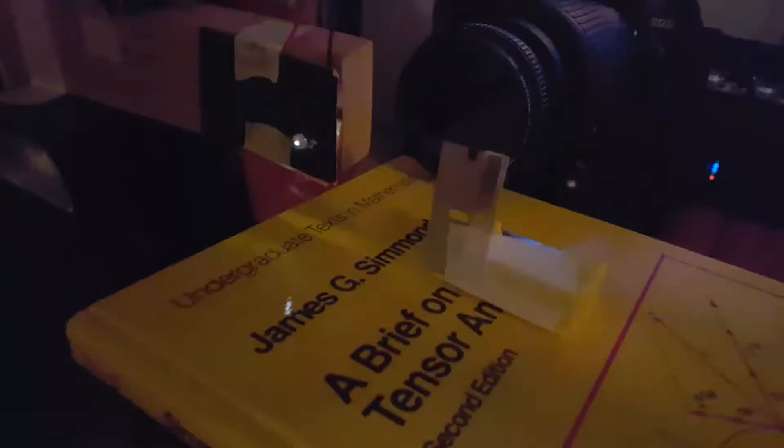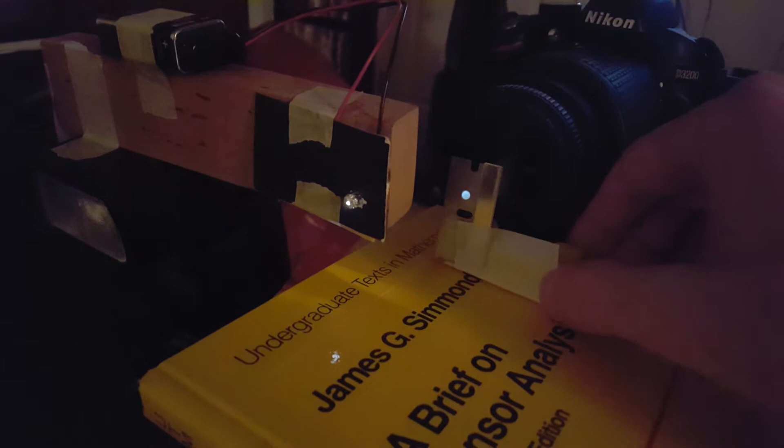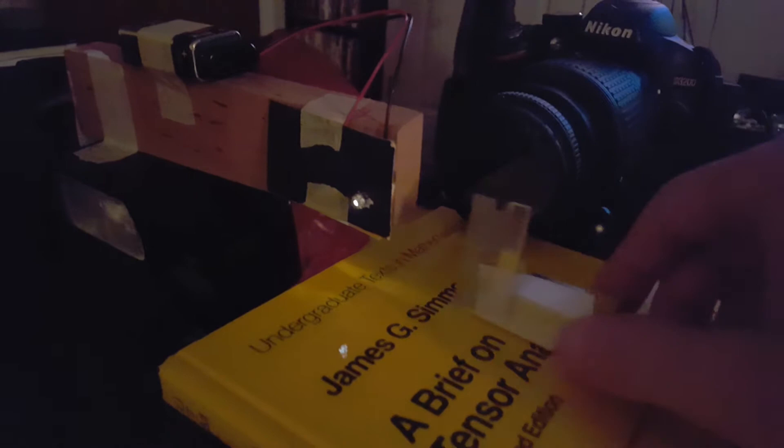You can see that I have a nice uniform illumination over the entire mirror surface. Now I'm going to show you what it looks like when we move the knife edge in from this direction — forward of the focus, behind the focus, and then when we're at the focus. Now I'm going to move the knife edge in and I'm well forward of the focus point, and as you can see it gets dark from the left hand side because we're cutting off that side of the light.